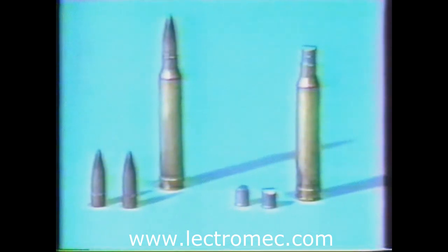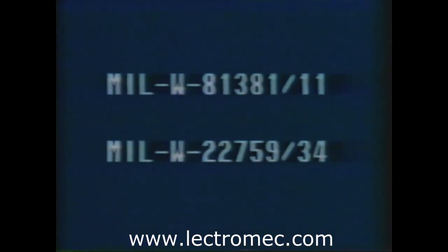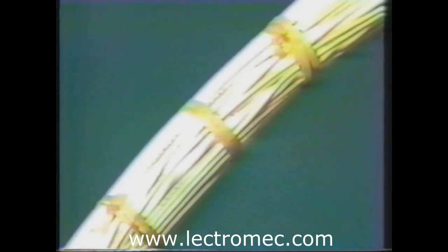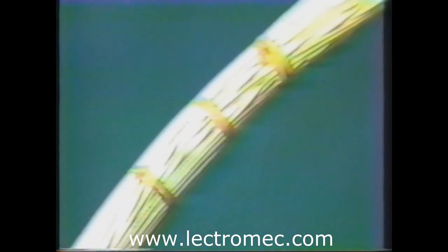For the test, two types of wires were used: MILW-81381-11 and MILW-22759-34. The MILW-81381-11 wire uses a polyaromatic imide tape as the primary insulation. The MILW-22759-34 wire type uses a radiation cross-link modified ethylene-tetrafluoroethylene insulation. Wire bundles were fabricated and mounted so as to simulate conditions representative of standard naval aircraft construction.